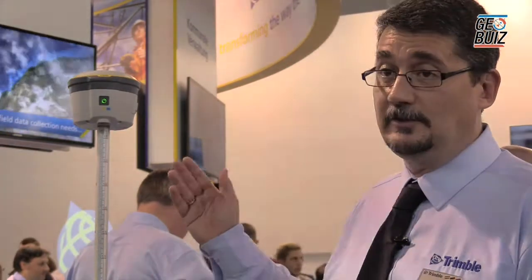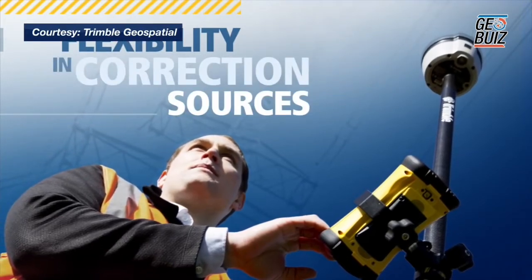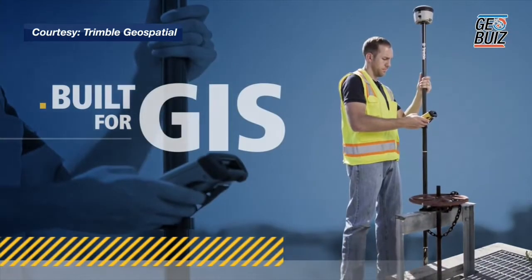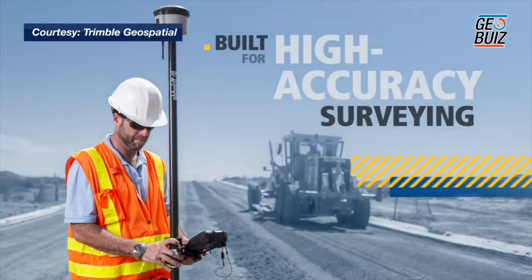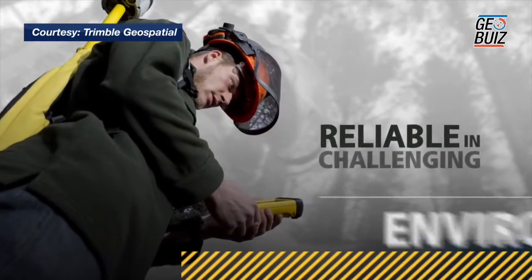For example, if you are talking survey workflows, a lot of these are stakeouts where you actually use the receiver on a pole. You go out there and mark locations with very high accuracies — that is the perfect application for this receiver. Also, if you've got buried assets and you need to document those locations with centimeter to decimeter level accuracy, that's where this device would be used. On the GIS side, when you want to relocate those buried assets, you also need that accuracy. So if you go in with centimeter to decimeter level accuracies, you're always within 30 centimeters — within the sub-foot range — when you relocate those assets.